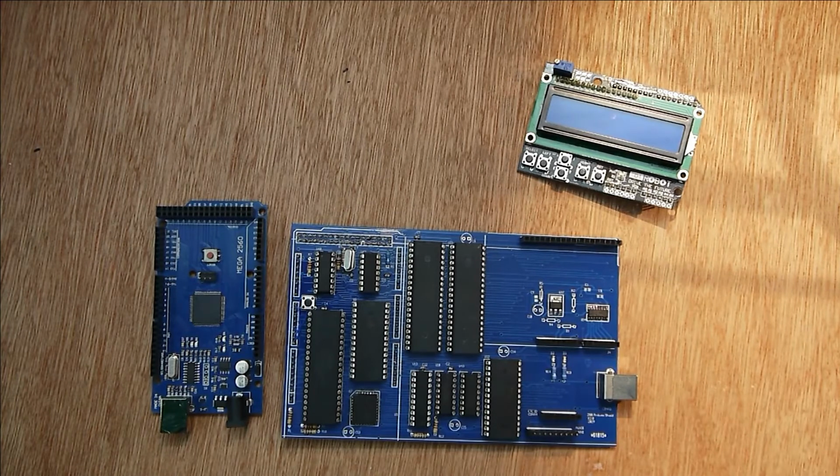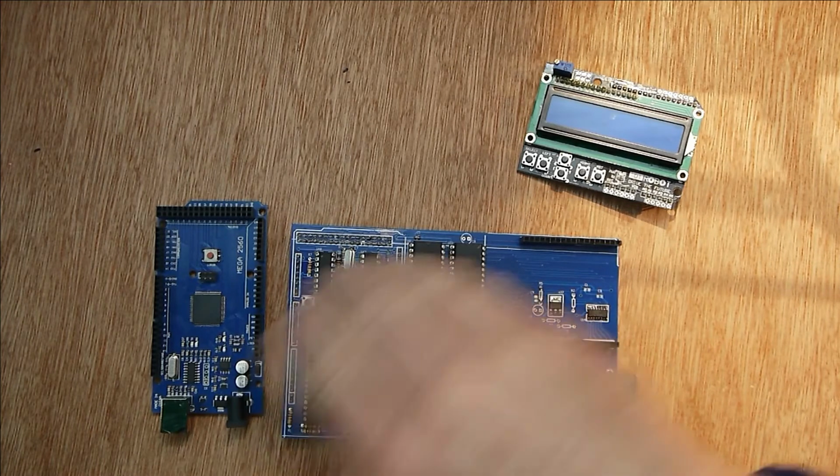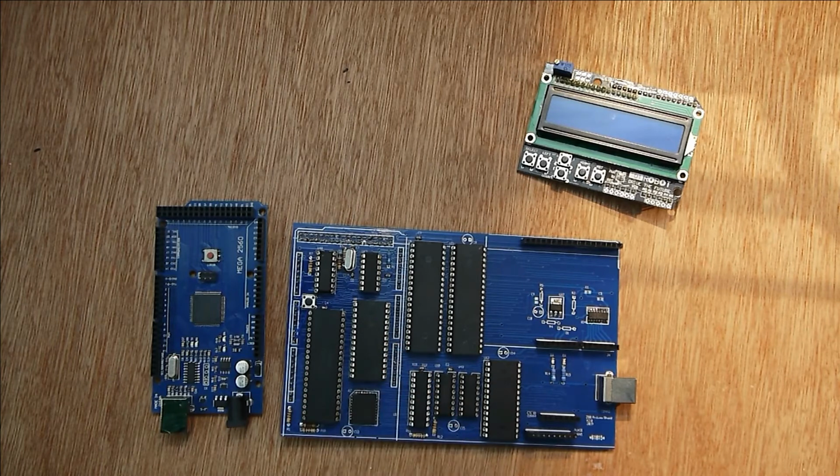So on the microprocessor, in the monitor program, when you want to see what's in the registers, the code that you're running, the monitor program, will go and grab the registers and then let you view them somehow through a menu option or whatever. On here, as you're emulating the code, because the Mega isn't the Z80, if you think of the Mega as being the monitor program in the microprocessor, then it will be showing you what's on the bus, but the only way that it can see things like register contents is by getting those out onto a bus. So the way I've done that is to arrange for a small bit of code, Z80 code, to be executed by the Mega in between every instruction of the Z80.